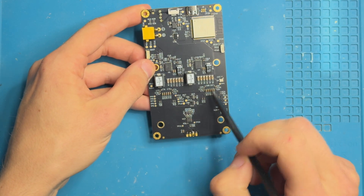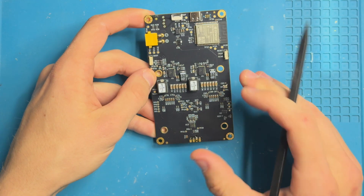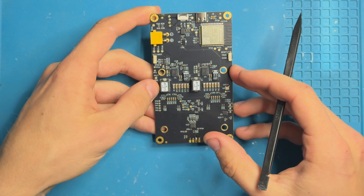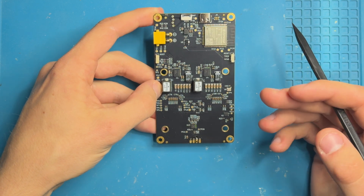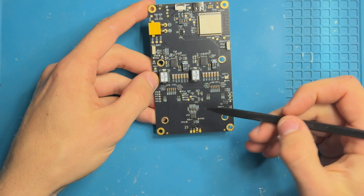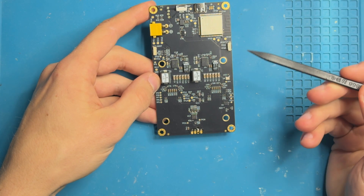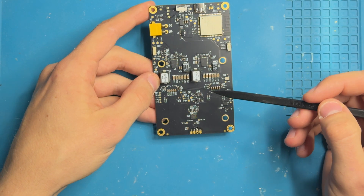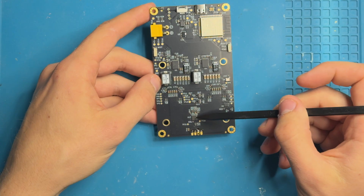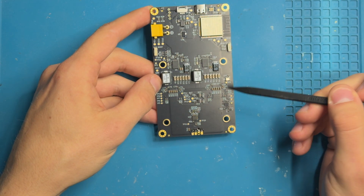With the EMC2103, we can read out both chip temperatures. On the web UI, you will actually see two temperature readings if you have a GT once it comes out. You can get yourself one of these if manufacturers are producing them, which I believe they will. Having two temperature readings gives you more accuracy about what exactly is going on with your chips — you don't want to just read one temperature, you want to read everything.